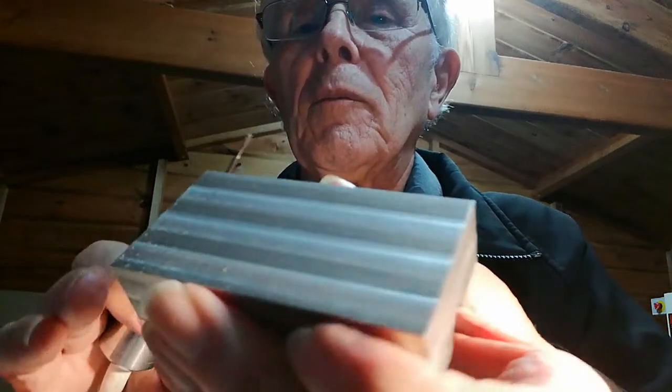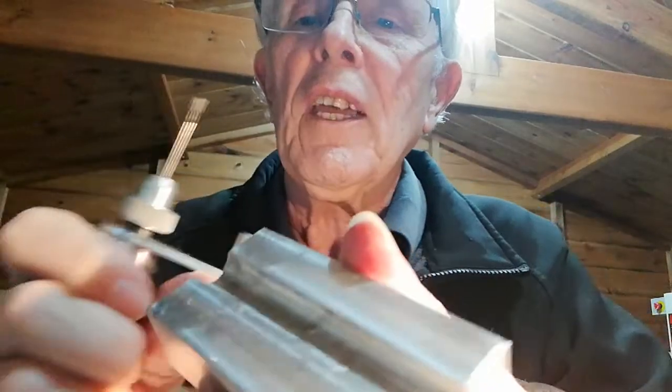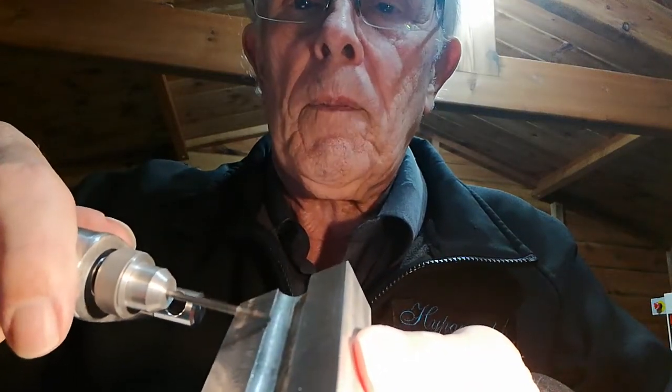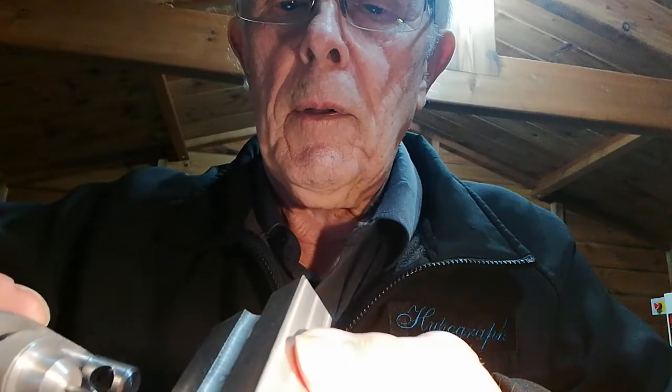So, when is a hypergraph not a hypergraph — not a tattoo machine — it's when it's a rotary file and drilling machine. There you go, that's that one. But also, I'll give you another example. This is one I did earlier — deburred that. It's a block of aluminium with sharp edges from milling. And we've got a groove down the middle sort of thing — it was just a test piece for something. Can you see the material coming off? It's taking it off that sharp edge. It's taken the sharp edge off.